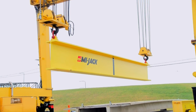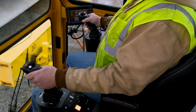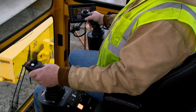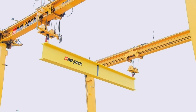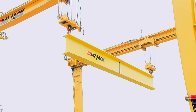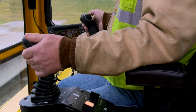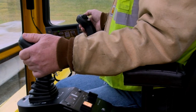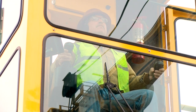The hoist mechanism uses a wire rope and drum arrangement. Each hoist is powered by a direct-drive planetary gearbox. A hoist brake automatically holds the load and prevents it from creeping down while the hoist is not being activated. The front and rear hoist can be operated independently or simultaneously. The chain-driven traverse system moves the trolleys along the top beams, utilizing a parking brake for holding the load while the traverse system is not operating. Each individual traverse system is powered by a hydraulic motor, and like the hoist, each one operates independently of the other.